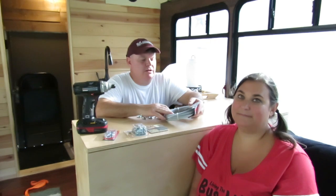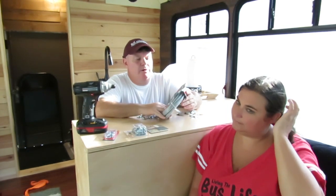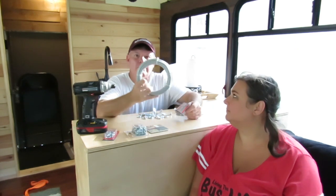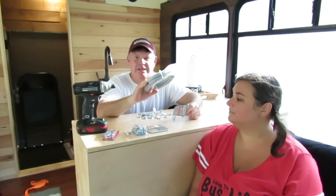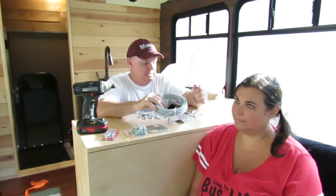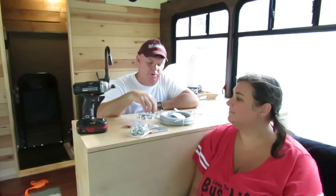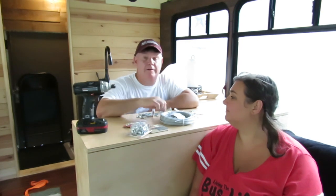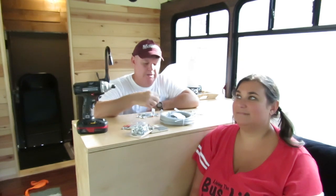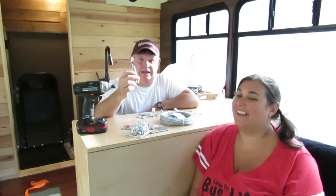What we're going to do — I've seen this done but not tried it in any of our projects — I went and bought some galvanized steel cable that's vinyl coated, a clear vinyl coating. It'll be easier for the curtains to slide and not snag. I also got some cable clamps, different sizes of eye bolts, some long ones, and some threaded ones in case I had to go through a wall and put a nut behind it. And of course I got the turnbuckles to tighten them up.